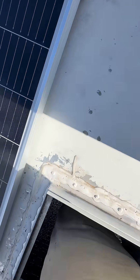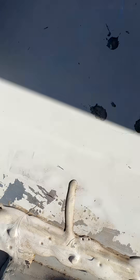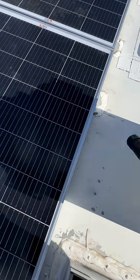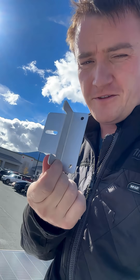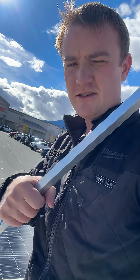Just trying to find the joists in the roof — I have one of them marked right there, the other one is marked right there. I'm using these little zed brackets, normally for solar panels, but I ordered them for this too. I'm going to use a piece of aluminum square tubing.